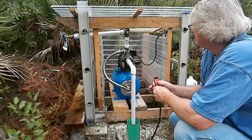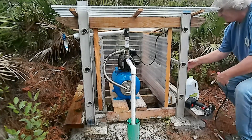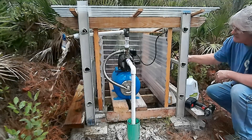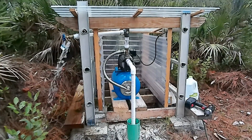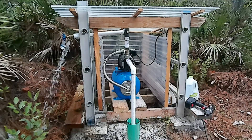Let's see if we need to do anything else, or if we can just plug it in and be up for operations for the winter. I did bring water just in case we need to prime the pump. I'm going to let that water run through the pump and tank, see if it keeps its prime, and see if the shallow well still has that pocket of water. So far it's looking real good. I'll let it run a bit more and then shut off the spigot to see if it will re-pressurize the system.